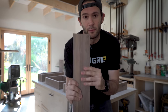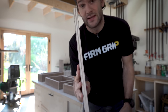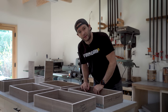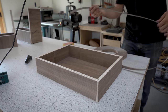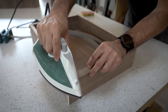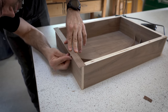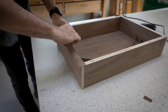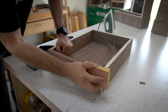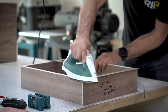Here's the thing about veneer plywood — it looks great on the face, but when you cut it you have a raw edge. So we're going to apply edge banding to all these raw edges to make them look like real wood. Edge banding is a thin veneer of wood coated in a heat-activated glue. You cut it to roughly the length you want, apply it with a hot iron and a lot of downward pressure, then trim off the excess. Nothing beats a simple razor blade for trimming — just be careful not to cut your fingers. I had a lot of raw edges to cover, so I spent the better part of half a day on edge banding.